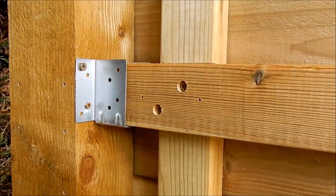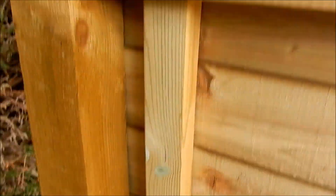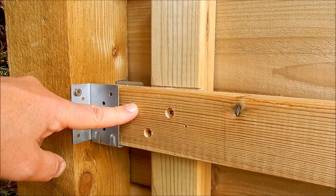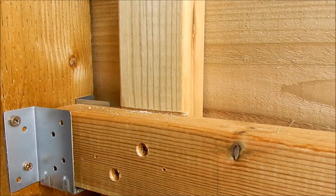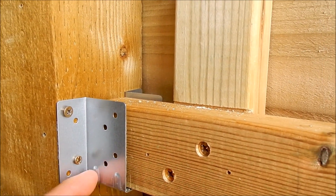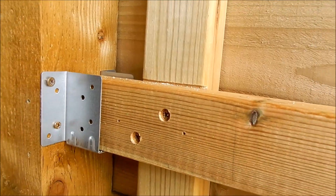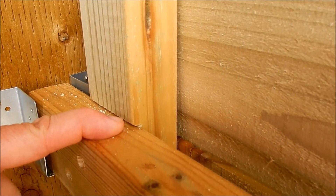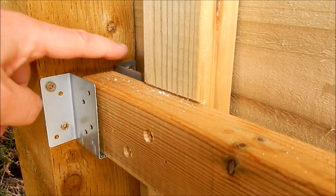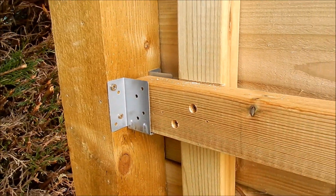The bottom frame I hung on joist hangers. There would also be a joist hanger down there, but since I've decided not to pursue this technique, I haven't bothered to put it in. The joist hanger is 47mm and this beam is 38mm, which means this has some play, so I can both hang this in the joist hanger and pull the panel against the framework by putting a screw in there. That works fine, but this was a lot of trouble rebating these timbers — these are both 38s — to get the numbers to work because I could only sit this central to the post. There wasn't any sideways play. There would have been if I'd cut the metal, but I didn't particularly want to do that. So that's one idea.